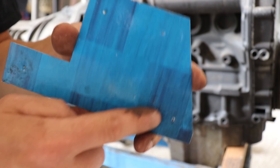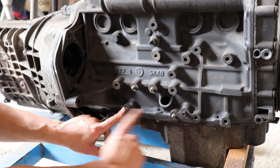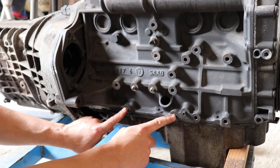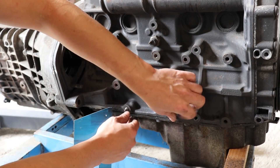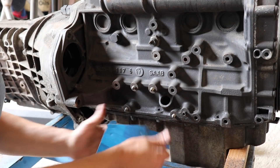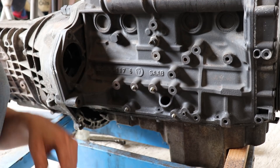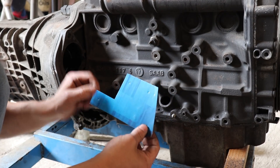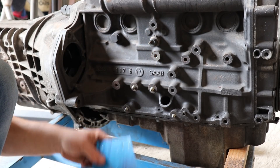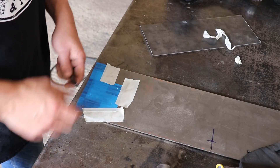You can see I've got my four marks on there. If you were just doing two and wanted to make a bracket across those two, you could put a piece of steel straight on, tap it with a hammer, locate it back on its mark, tap the other end, and it'll give you an exact mark. But when you've got more than two, that becomes tricky because you might not get one quite lined up when you hit the other. So it's easier to get it onto a piece of card first. The tape is just holding it in place so it doesn't move when you do the punch marks.